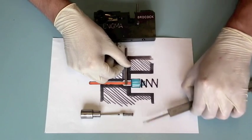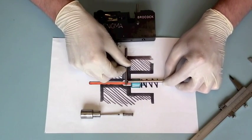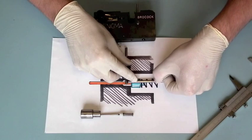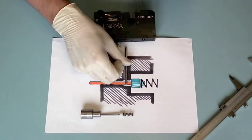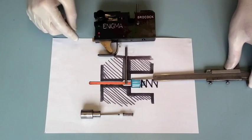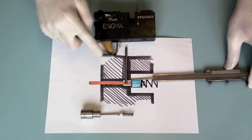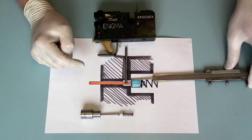So what I mean by this is, if you were to get another metal rod, you could put this in until it touches, and then use a knife blade just to mark across the flat end of the air rifle action to put a mark onto the rod. So that's that, and then what you do after that is simply put your measure or whatever back in, and you'd measure to the face that the outlet valve itself sits down on, and then you can take one measurement from the other, and that will give you the thickness of the adjoining wall, so you'll know what the maximum size is that you can go up to.